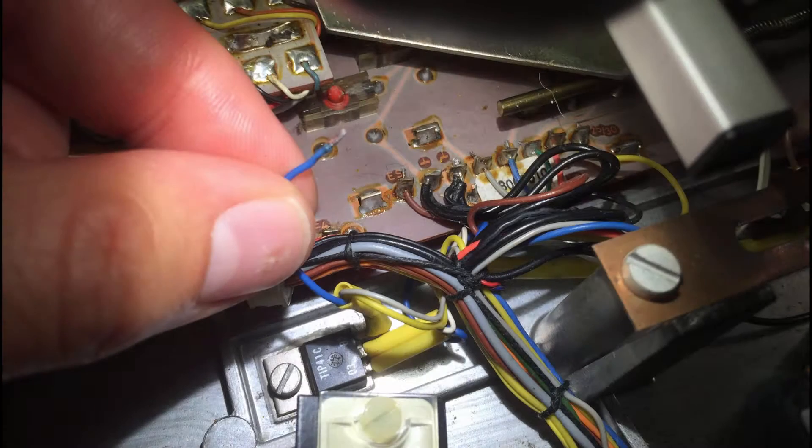The problem was quickly identified. Here you see transistor TR4, it's a TIP-41, and if you look in the datasheet you can find out that the leads are base, collector, emitter. The emitter here has the blue lead and that goes to the resistor on PCB-7 that you see here in the background. This lead here was broken off, which severed the connection to the resistor.